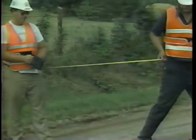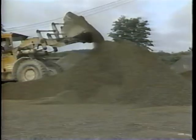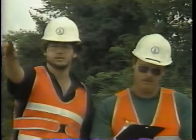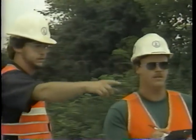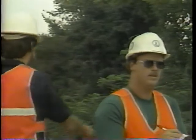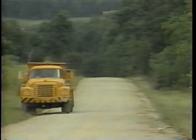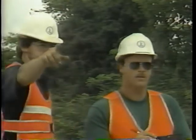Before the work starts, determine the amount of gravel needed and its supply source for this operation. Also, determine if a detour is practical or if one half of the road must be re-graveled at a time. A detour will direct traffic away from the work site, making this operation more efficient and safer.